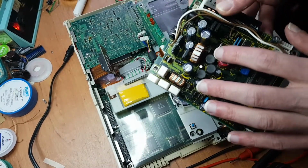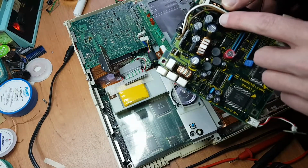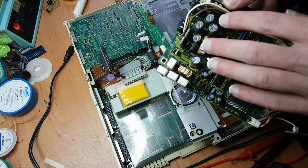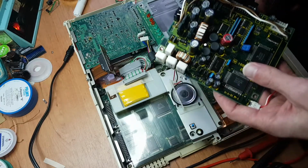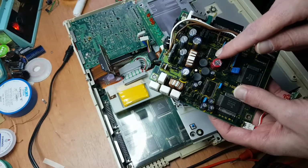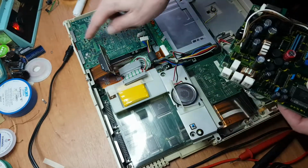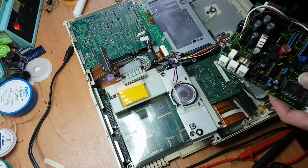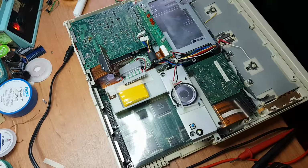And when probing around, I noticed that the 5 volt and the main buck boost converter, which steps up the battery voltage, yeah, those are, no, I don't know where they are. I'll have to look it up in the schematic, but the ones driving the main buck boost converter and the one driving the 5 volt buck converter on this one, they were both starting up, and then the 5 volts would spike way over 5 volts. And I don't actually have a digital oscilloscope yet, and my analog scope is just way too slow. The multimeter is too slow, you just can't see it.